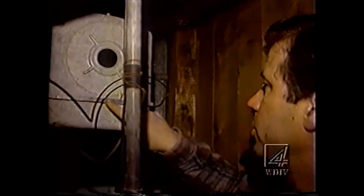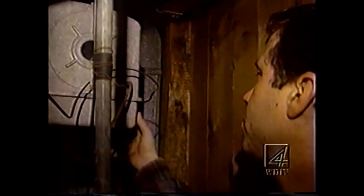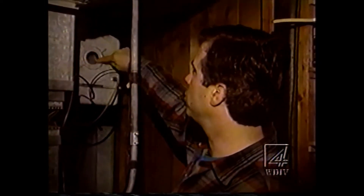We're going to go ahead and put this back in place. I'm going to check my water level in there — plenty of water. Every other year or every few years, we'll take this bottom portion off and scrape all the sludge out from in there. Use half vinegar and half water and it'll break off some of those minerals. Before we put the top on, we'll go upstairs, turn on the thermostat, make sure the furnace is running, and I can make sure it's turning — that's why we have this little window here.